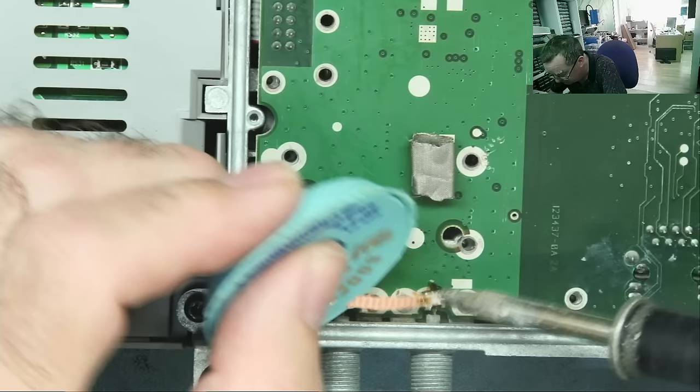What voltages do we see on the connector now? Well, let's have a look. So I think this was the one that was around 12 volt wandering. Now it's 12 volts. Okay, I think these four were all ground, and then we had some grounds and some voltages. That's a plus 32, looks much more sensible now. That's a plus 20. Oh, that's going on and off. Unless that's had a bad connection. No, that is just going on and off. Maybe it should do. That's a plus 24.